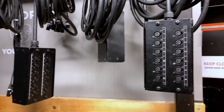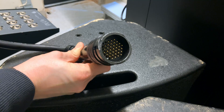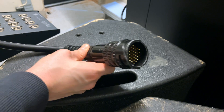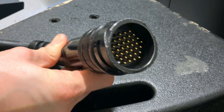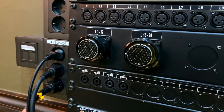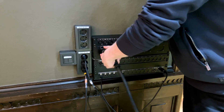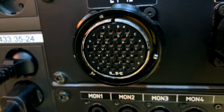As long as the correct cores are wired up at each end and labeled, you're just sharing a shield and enclosing it all in one body. There's also a possibility to make this even more practical: on the end of the cables, we can install multi-pin connectors, meaning it's not a standard XLR cable at the end — it is one connector with multiple pins instead of just the three in an XLR. If we have the right infrastructure, we can use something like an LK connection to connect all of these pins into a stage box. When you screw these together, the correct channels all line up — so channel one on the stage box is lined up with the channel one cores in this multi-core.